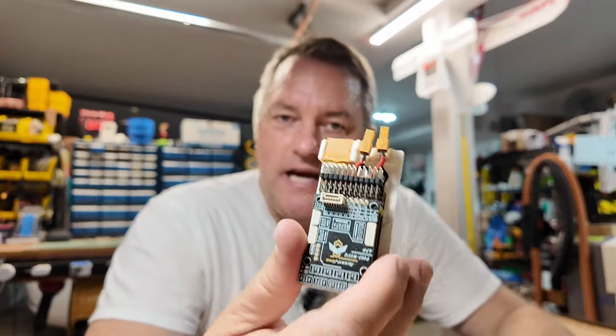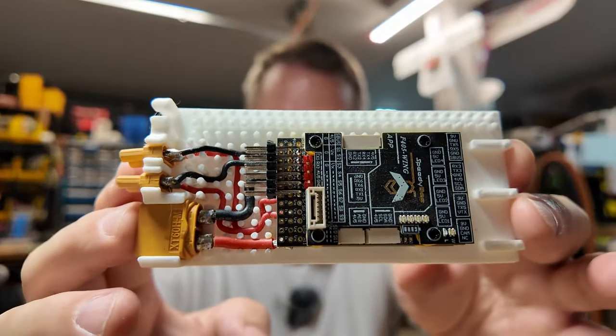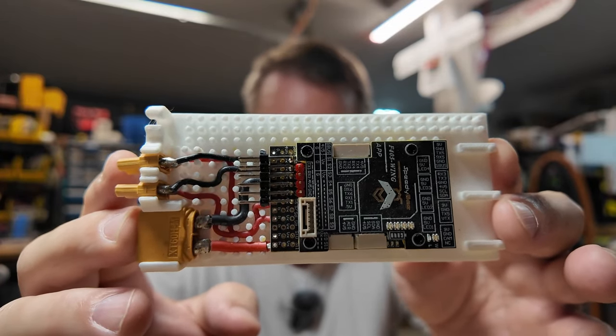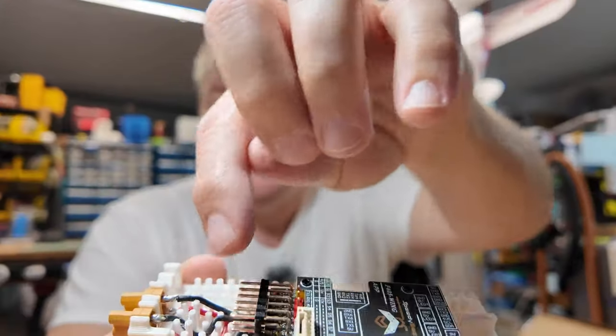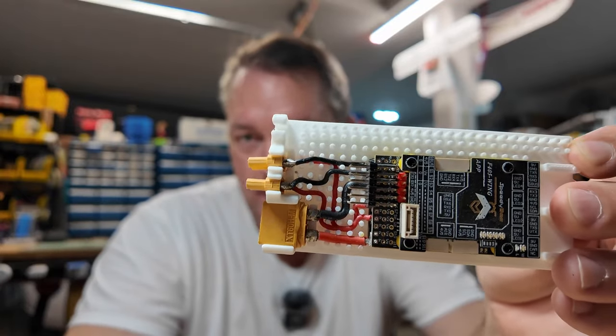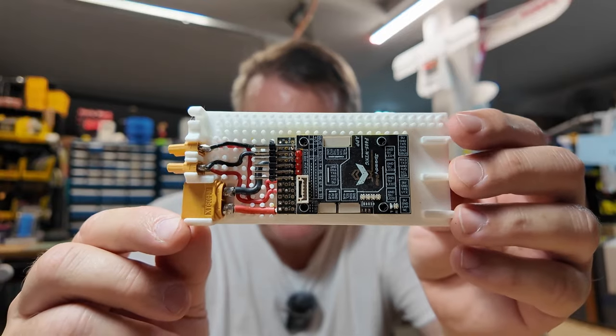I've had a bit of a change of heart, and this design evolved mainly because these solder connections are pretty tight and small. I wanted a little more room, and I found not much was lost if I integrated a wiring jig into my flight control mount. This next board is a 50-millimeter wide board — the interior width of my fuselage. For a tractor configuration, I came up with this pin design. The idea is that I could put the wires in, orient them however I wanted, and avoid floating high-current DC wires that could cause magnetic interference to my servos. Servo wires pull frequently aft to the tail surface or out to the wings, while the DC power going to the motors is captured low in the fuselage and away from the antenna and GPS.